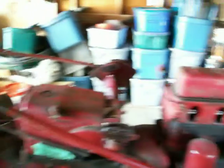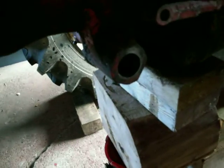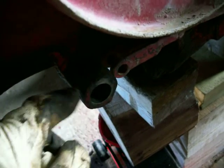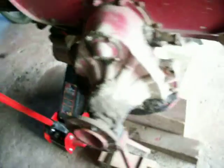Then we can start putting all the parts back on. So we've got our tire pulled off and pulled out the shaft. There are two bushings in here — a bushing and then about a quarter inch gap and then another bushing on the other side. The space between is for the grease channel, so when you fill it up with grease and rotate — there we are.